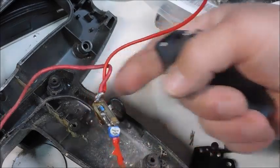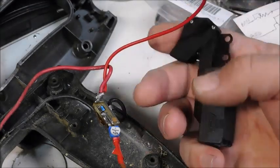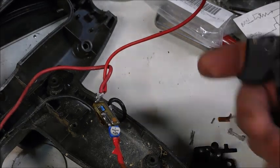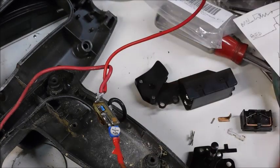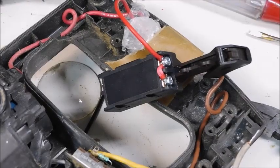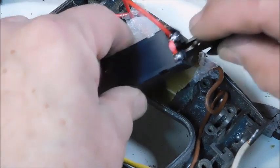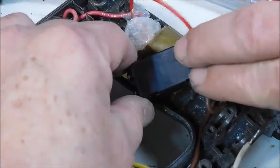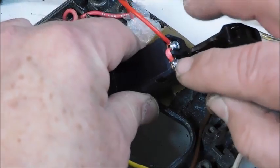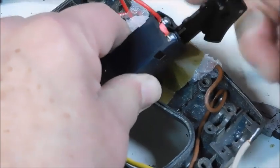I had to tear that whole circuit board out and re-solder the wires, put the resistor in, and now I can just hook it up to the switch. It's another repair done — took something that was useless because you can't buy the switch anymore, and turned it into a working item again. I doubled up the wires on the switch and I'll do the same on the bottom — there are two sliders in there and I'll utilize both of them at the same time to hopefully keep the arcing down and make this switch last many more years of use.